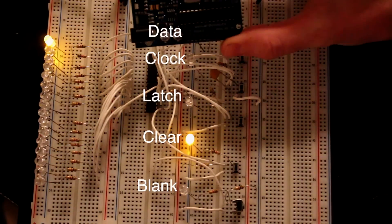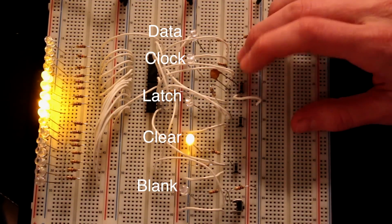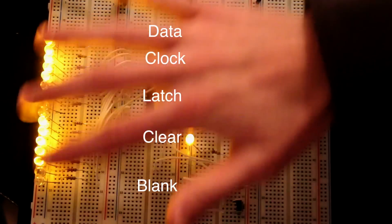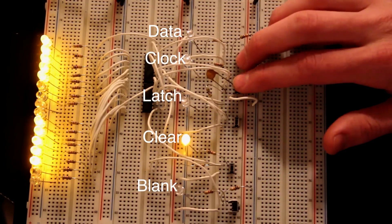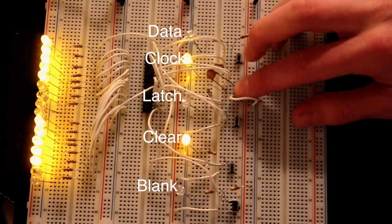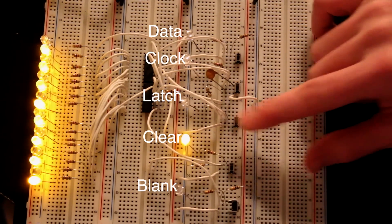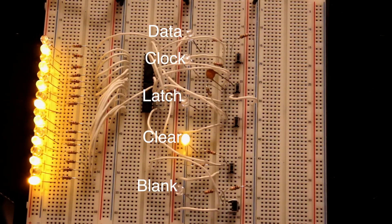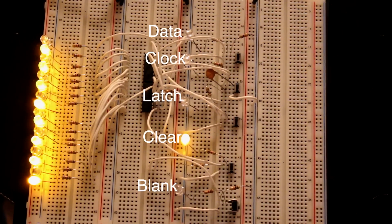That's pretty much the tutorial. Typically with a microcontroller you would have all of your outputs set and then when you wanted to update, you wouldn't latch the data until you've set all of the outputs of that shift register. To demonstrate: I'll set the pattern to one zero one zero one zero one zero, and let's see what happens — and there it is. That's how a shift register is actually implemented using a microcontroller. Hopefully this demo sort of drives the point home as to how shift registers work and how you truly can control all of these outputs. Thanks for watching.